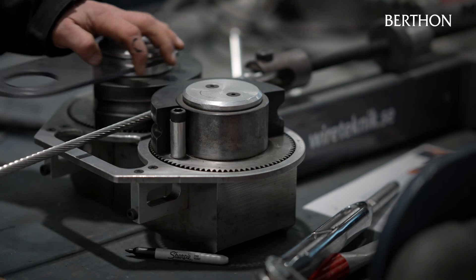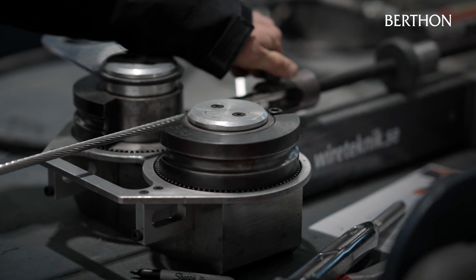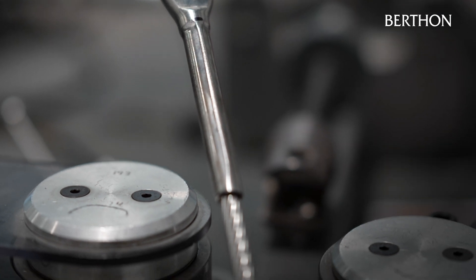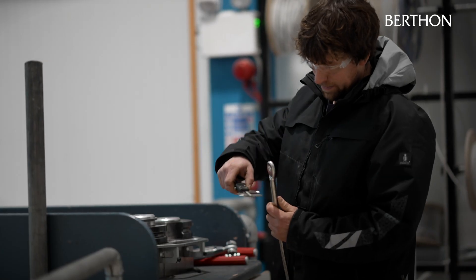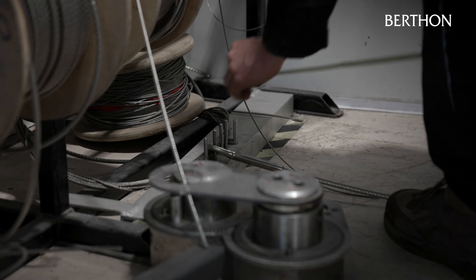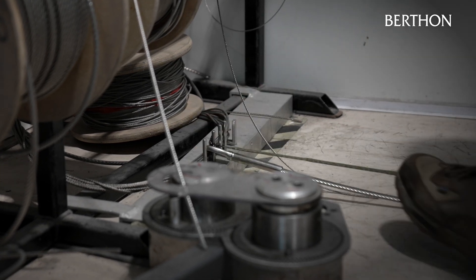Afterwards the tolerance can be checked to make sure it's being crushed correctly. When the yacht comes in, I'll look up the mast, see if it's straight, and make sure nothing's bottomed out — there is still adjustment left, because I don't want to copy one that's wrong. Then it's literally a case of copying the old ones. You can measure it and write down the measurements, or you can lay the old one out. Using that as a guide, we swage on the top terminal and measure it out along the floor.